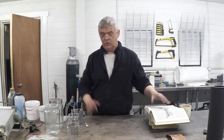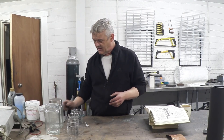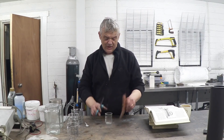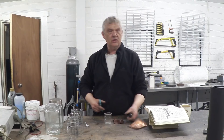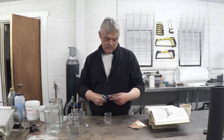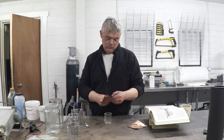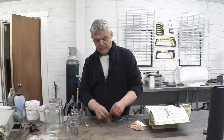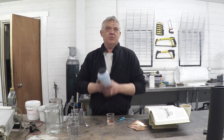We're going to make a small one. The guy in the article makes absolutely huge ones — things that size — and puts like half a kilo of material in there and runs them for ages. We're just going to make a little demonstration one. It's really simple: you need a bit of copper foil, because what's going to happen is the device is going to sediment copper and this foil will get thicker, so you don't need an awful lot of it. Cut it into an L-shape, bend it into an S-shape, and stuff it into the bottom of your jar so a little bit protrudes out that you can connect to. Then put a generous amount of copper sulfate in there.